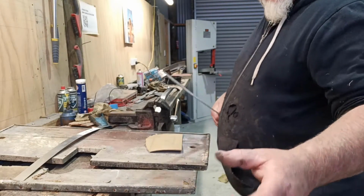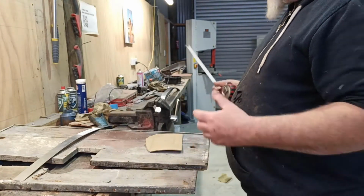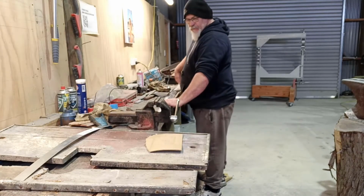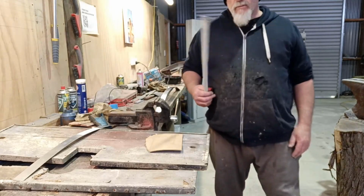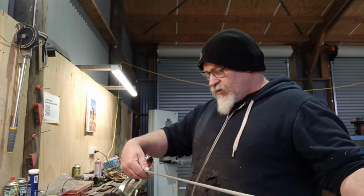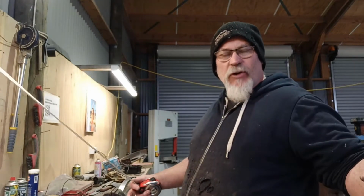A little bit over 1200 long, doesn't matter which one I do, that's 4 foot, and dead on 4 foot I think. Yeah, dead on 4 foot. Normally when you're dealing with lots of plywood, it's normally 1200 and a bit, like 1240 or thereabouts, so you get a little bit to play with, but that sheet is dead on 1200, which is basically 4 foot.